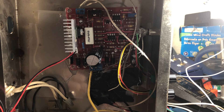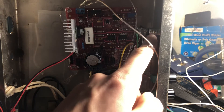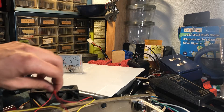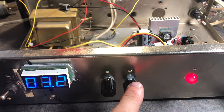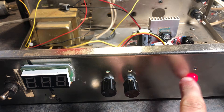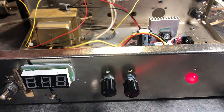I do not have my amp meter set up yet, so there are no extra wires for it. But as you can see, I have threads here — this is for my indicator light so I know it's on. If I go to lower voltages and didn't have the fans plugged in, I would not know if it was on or not. This is only designed to go to a minimum of about three volts, so if it's not lower than three volts you don't even know it's on. That's why I have this red light — it's a little AC/DC mini light bulb. I recommend you put one in when you build this.